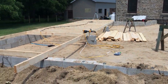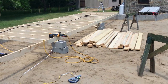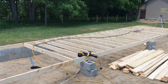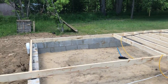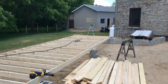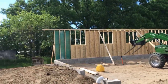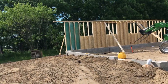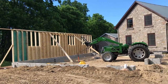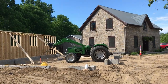Here we are — we have the block all finished. The outside is all backfilled, the inside is all backfilled with sand and that's all packed down. I'm framing a 2x6 wall; this is the back wall of the first floor. There's no windows in it so it's pretty easy to frame. I did it all in one shot with the exterior sheathing. I thought I'd be smart and use the tractor to lift it up, but a miscalculation — I was a couple inches short of getting it over top of the bolts. These are the bolts that are in the block to hold the wall to the block. Luckily a neighbor saw me struggle, he came over and gave us a hand and we got it into place.